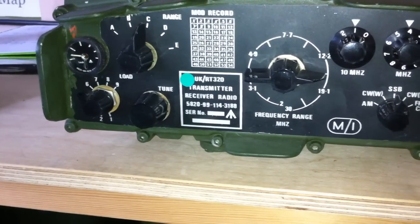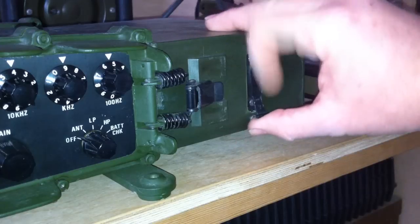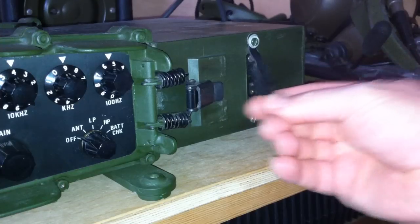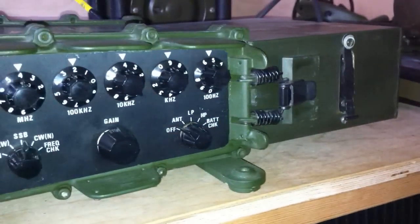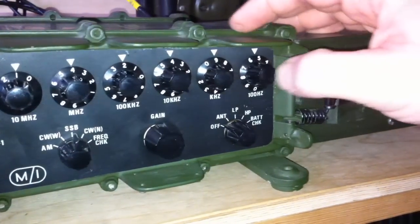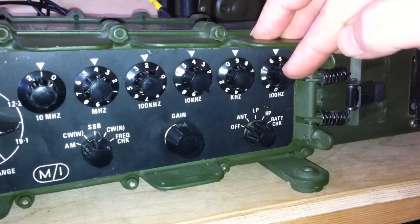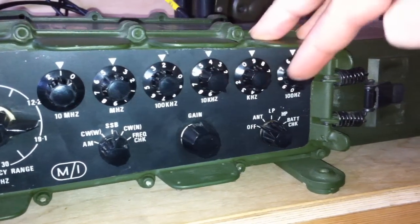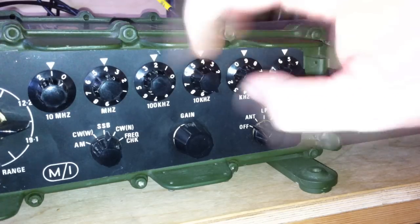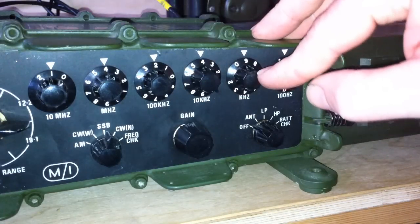We'll start at the beginning. I'll give you a quick look up and down the radio. On the end is a 24-volt battery with the plug-in for it — we'll come to that later, where a device called a DCCU, that's for the charger, comes in. These are the Decade switches, which are a bit notchy — they go down to 100 Hz. At the moment I'm on 142495, which is really 142475, because these dials show the suppressed carrier frequency.